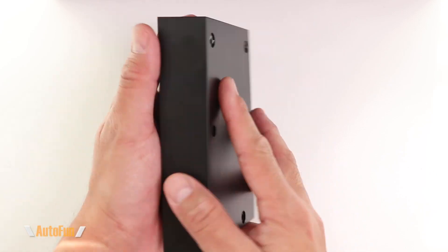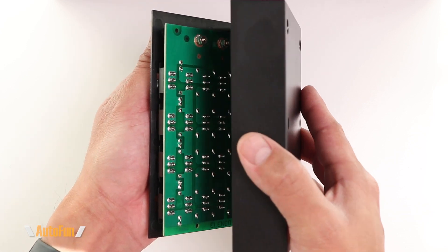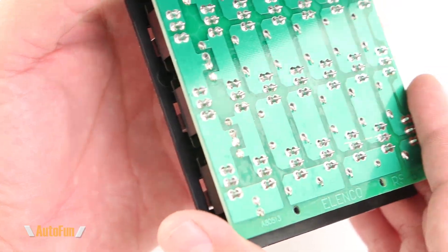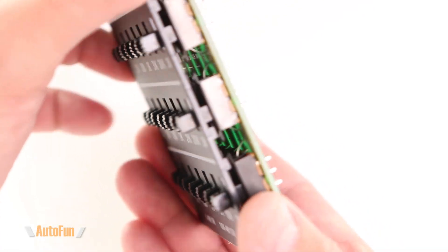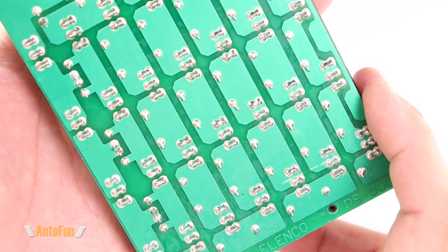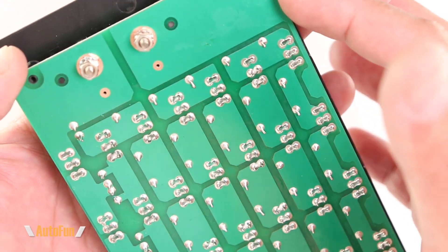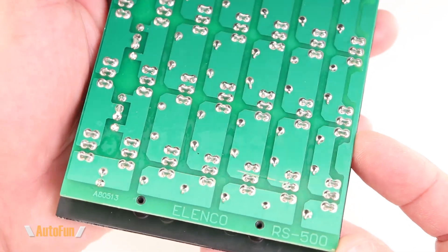Let's also take a look inside of this box — I have already removed the screws, so let's open it up. Before we look at the resistors in the front, I want to show you the solder joints on this PCB and also the size of the traces, which is what's going to limit the amount of wattage this box can be used with. It's not only the wattage rating of the resistors, but the traces themselves, that limit how much power we can actually drive through here.